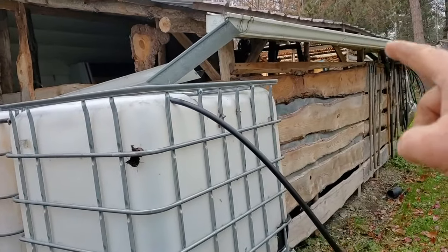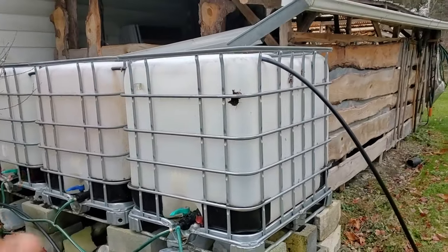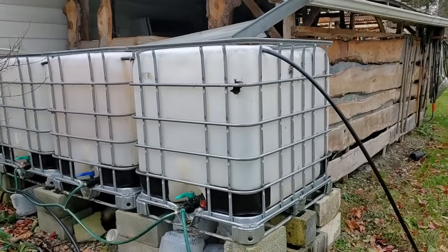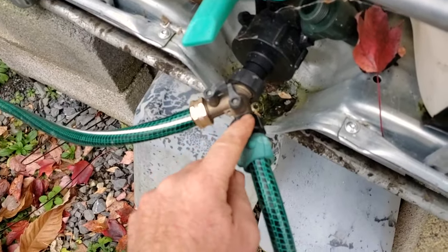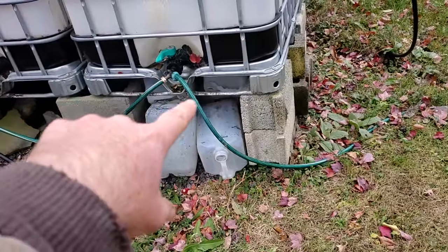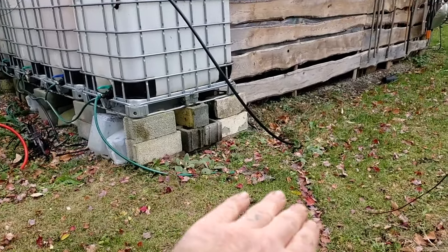The good news is you can see here a simple gutter system with a little shunt that goes through some filters and into this first tank. I do not have to fundamentally change the downspout to go somewhere else — I can leave all of the incoming where it is. I just open all the valves that equalize to this first tank, and I add a little shunt so water can leave. As it's coming in, if it's snowing it won't come in, but if it's raining it will. I have the hose come downslope to an overflow drainage ditch, so all the water that comes in for the winter freely flows out and away.